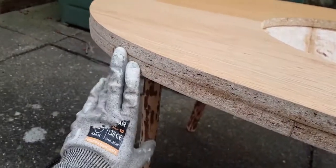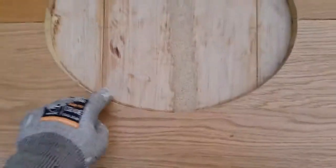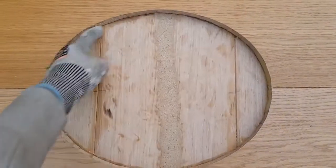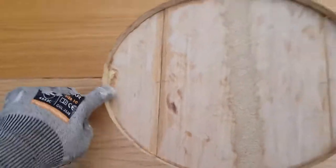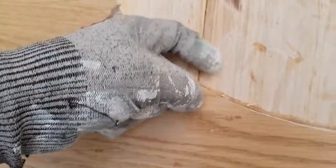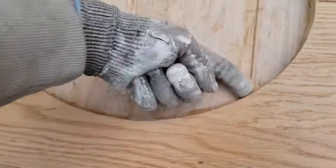All of these catch bits and stuff — I need to level this all out because at the moment it's just bad. So I'm going to sand that all down, make it good, and then probably bring a chamfer on the inside so it comes in at an angle underneath. I've got to do the same here — make sure I round this off a bit because there are some bits that stick out. Round this off, fill in the gaps. I already did a bit of fillering for gaps here and it actually looks a lot better there than anywhere else. But I've got to cut off the excess glue — I've got lumps of glue here from where it came down because it was upside down when it was glued. It's leaked out.